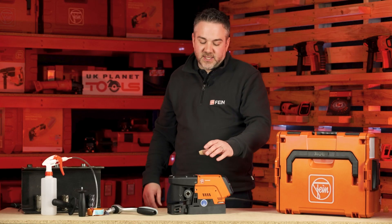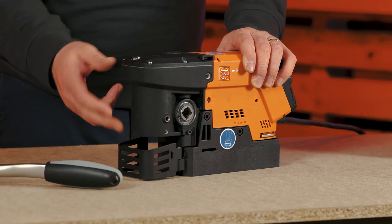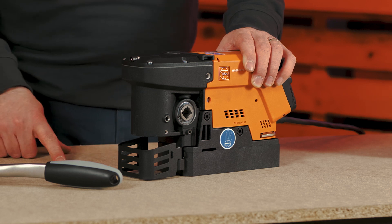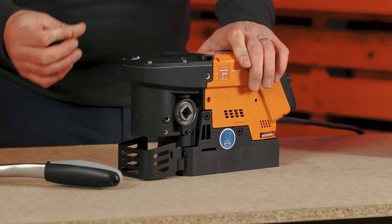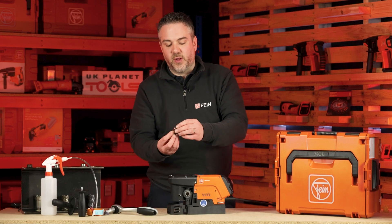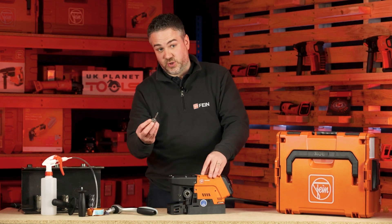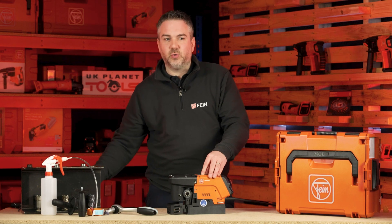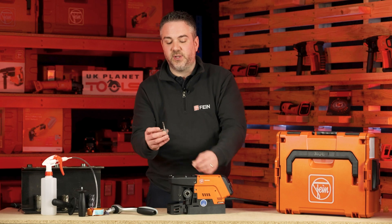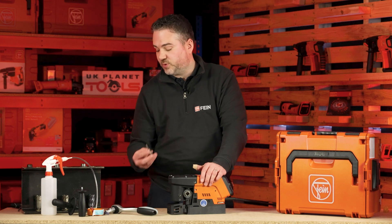The machine has a 1200 watt brushless motor. It has a drilling capacity of 36mm with a depth capacity of 35mm. You can twist drill up to 16mm, and with the twist drills we use a Weldon fitting which you put your twist drill into so you can do your twist drilling. You can also tap up to M12, and we have the same system — a Weldon fitting with your tap that fits in to do your tapping up to M12.